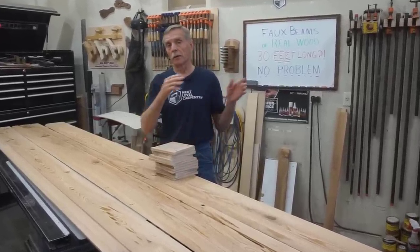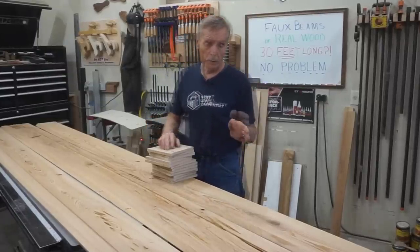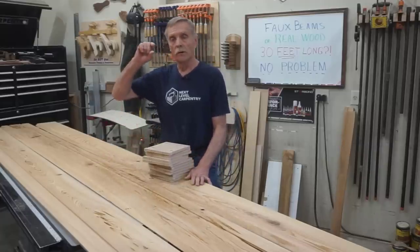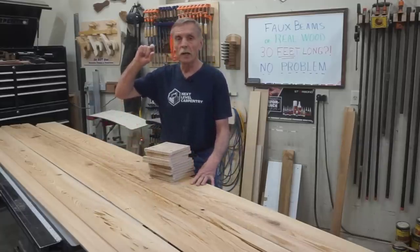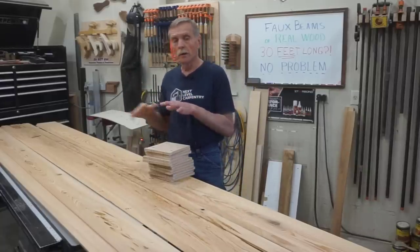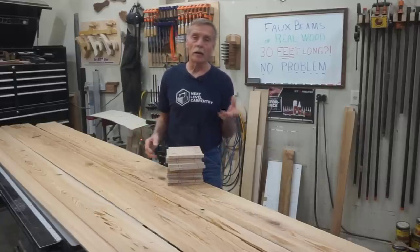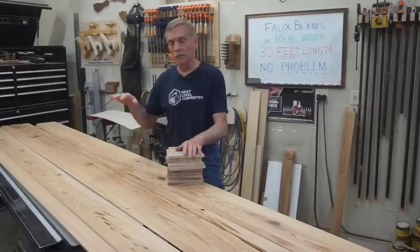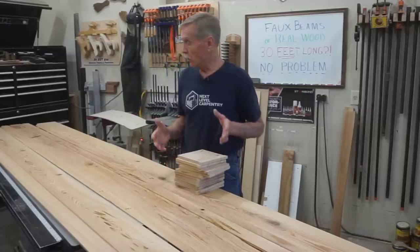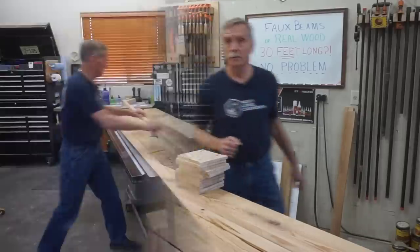So that's kind of the overview beyond DIY carpentry stuff I talked about, because before I started shooting video for this, I took these boards from a rough inch thick with all kinds of issues, got them all clean, flat, straight, and true before I proceeded with the joinery. But if you're into making beams of this scale or this level, then the capability of getting true and flat boards is within your wheelhouse. So with that overview, I'm going to do a little bit of layout and show you how this comes together.